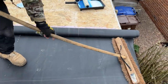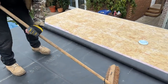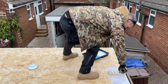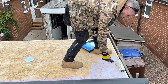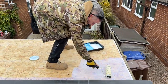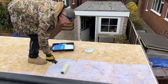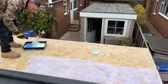I did a bit of digging and found out that yeah, you don't actually need it on this application — it's a flat roof, there's no upstands, there's no abutments. I'm quite happy that we're not using the contact adhesive because it's mechanically fixed. Once we built a garden room for somebody and they wanted it moving, and we'd got as far as getting the rubber on the roof — so we had to strip it off again and it was only down a day — and trust me, that rubber was not coming off that roof whatsoever. I'm going to keep working my way along. When rolling on the ends, go sideways — that way there's no risk of falling off the edge and getting glue all over your fascia.